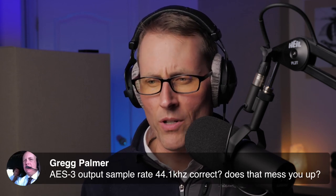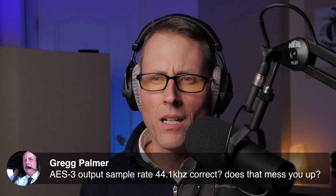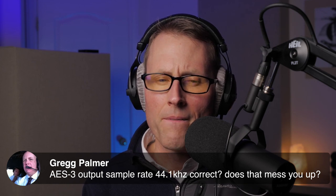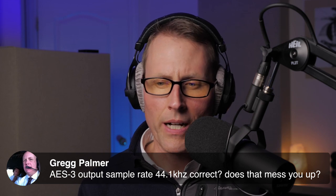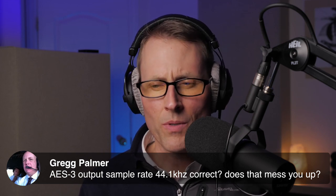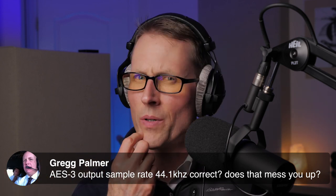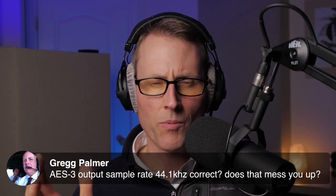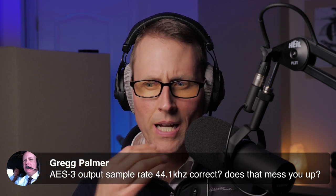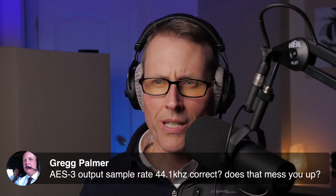AES3 output sample rate is 44.1 kilohertz, correct? Does that mess you up? I always thought the recording went into 48, but I need to double check that. Greg, I know that the transmission on the A10 system is 44.1, but I don't know if it's doing a resampling or not. I think it's always been recorded into 48 kilohertz. You basically set the sample rate for the recorder, and everything gets recorded at that. So there may be some resampling going on there at some point. Good question, and something for me to look into.